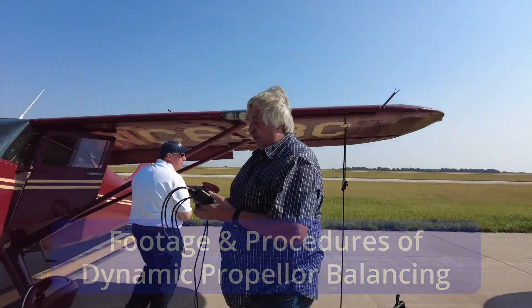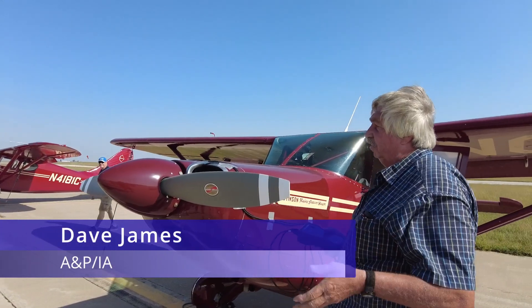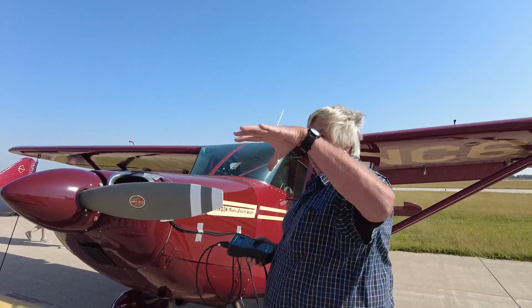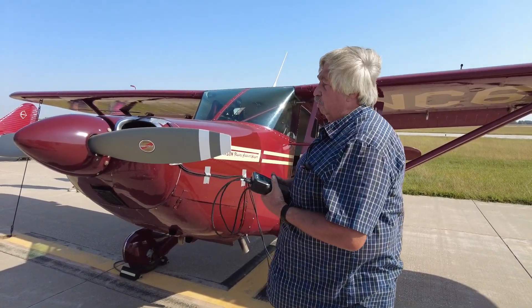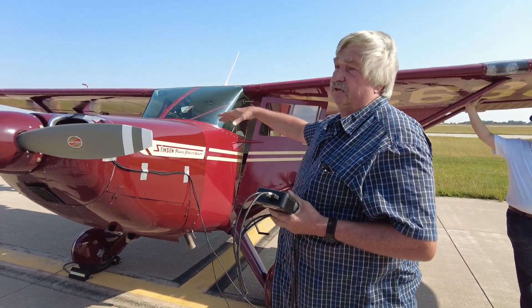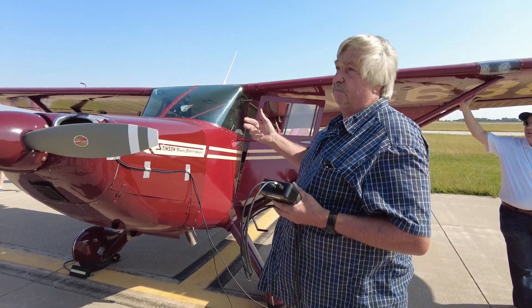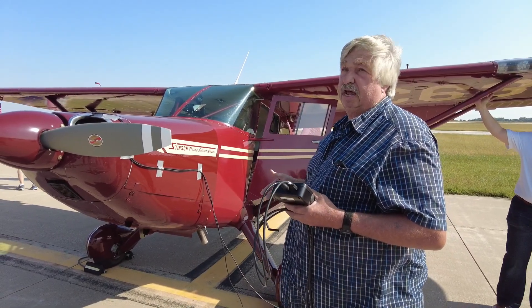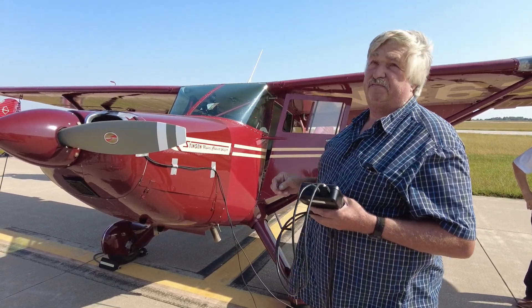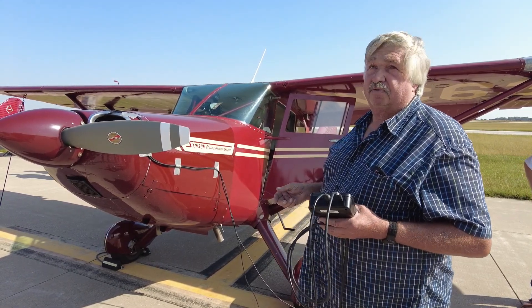Come on up in front of the airplane, we'll show you what we hook up. The old school way before dynamic balancing equipment was the prop shop would do a static balance on your prop when they got it out of the shop after overhaul. When you put it back on the airplane, that doesn't necessarily allow for any imbalance in engine internal parts. If you balance the crankshaft, rods, and pistons all down to the gram, and static balance the propeller, put it back on and run it up, it requires very, very little weight — like 13 to 15 grams, about a half ounce.